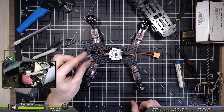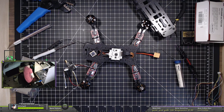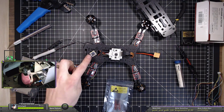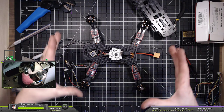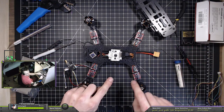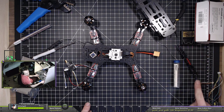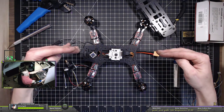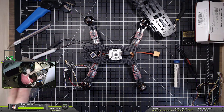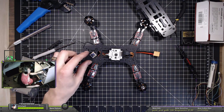And basically what this will do is it'll take all that information, and we'll program it using an FTDI adapter. So this is what connects this chip to the computer, and we can basically take all that information and tell it, say this was our camera, we can make the battery voltage show over here in text. We can put throttle and stuff over here, and then we'll have the artificial horizon line, and it'll move like a jet, and it'll overlay that text on top of your vision. So it's almost like having a virtual cockpit.